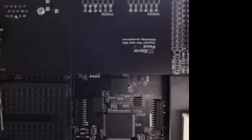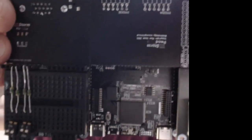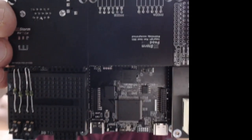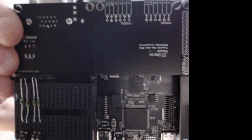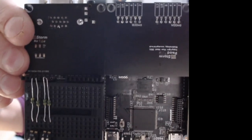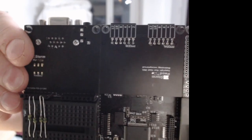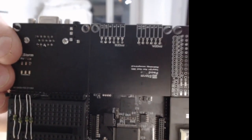You can see the componentry for the tile there, which would normally sit under the mezzanine. Can you see the big LQFP 100 pin STM32? That was the bugger that set me back longest. Then there are the two USBs at the bottom, the holes for a debug connector, and the DFU switch. Above the STM32 is the flash chip, the FPGA, and the HyperRAM.